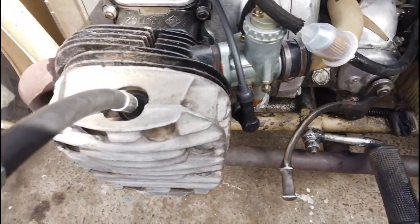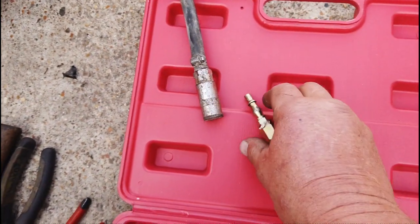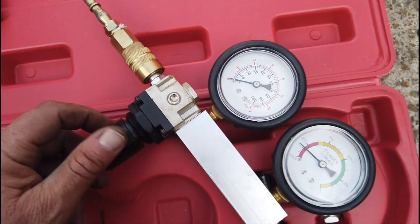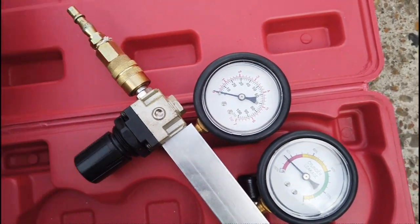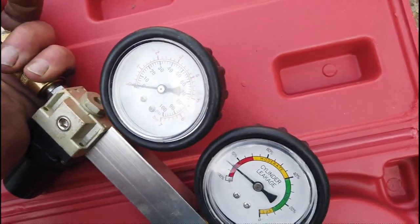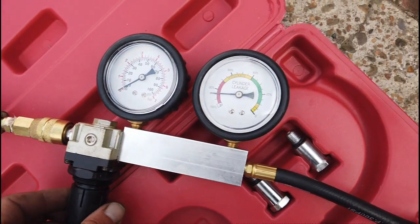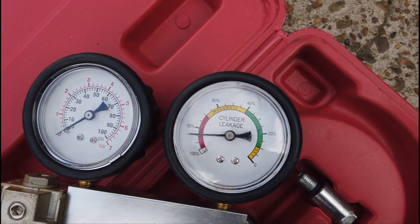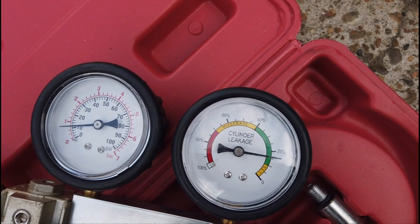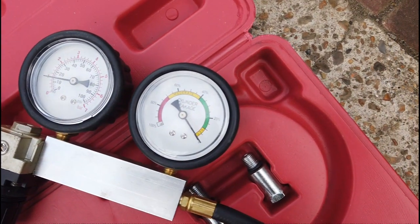What you need to do is depressurize the system before you connect up to the airline. You depressurize it because if you add pressure and it's already fully up, there's a good chance of damaging the gauge. So wind it right down, plug the system in so you're getting pressure, then slowly wind up the gauge on the right-hand side until you get it reading zero — that's like a calibration, a starting point. Wind it up until you get to the null or set point, which means zero percent leakage. Then lock it off so you don't accidentally knock it.